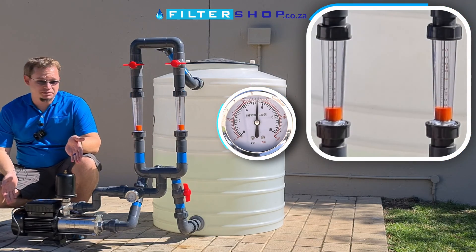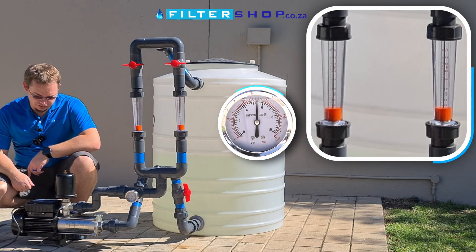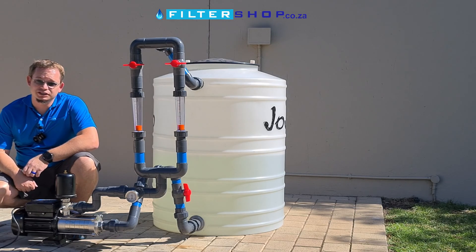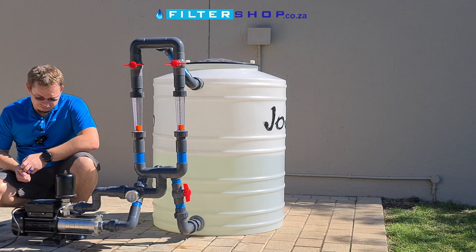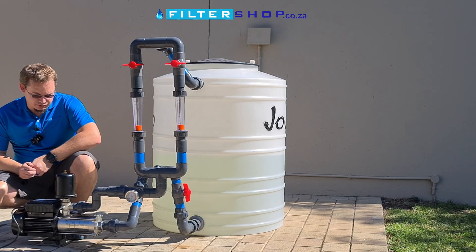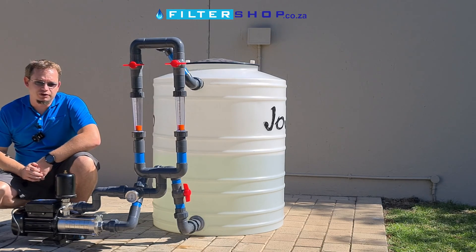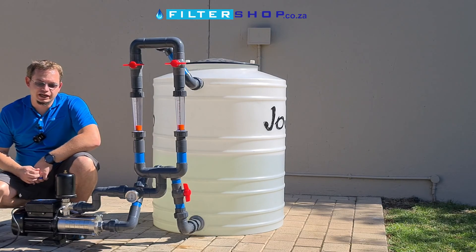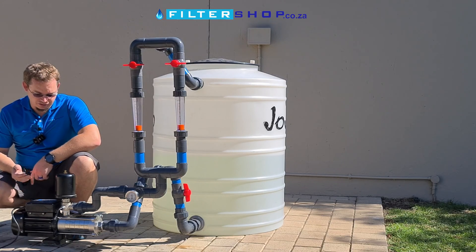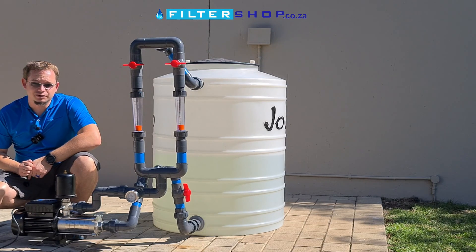In conclusion, the HMS pump can do quite a bit more than just domestic applications — it did quite well flow-wise. Really impressed power-consumption-wise, as it did much better than expected for high flow. It stayed relatively quiet, although at higher pressures or higher flow the motor does spool up a lot more, so it is louder than at a normal domestic application. But overall: great power consumption, corrosion resistant, and capable of supplying quite a high flow.